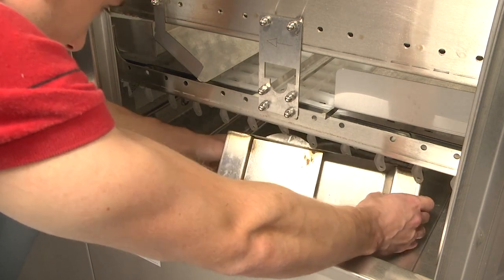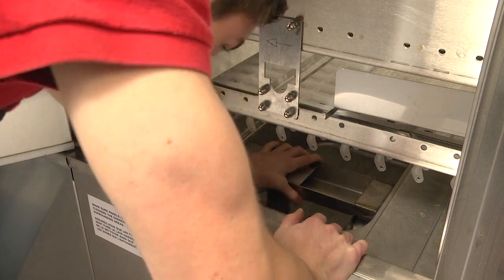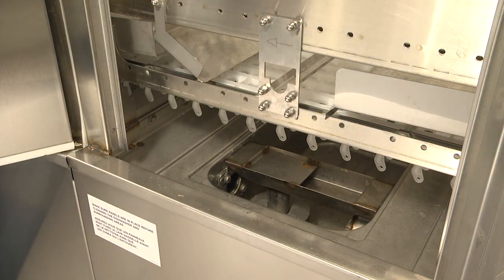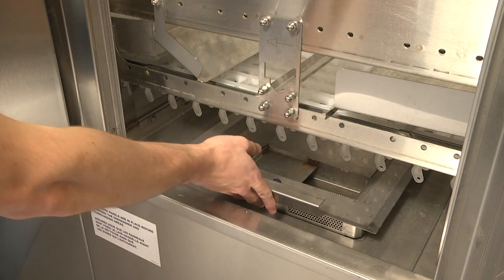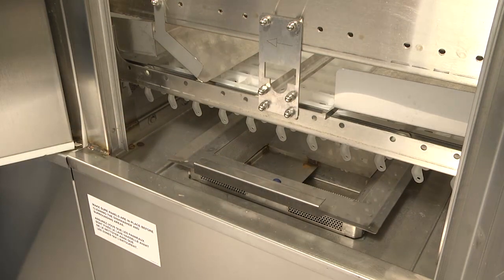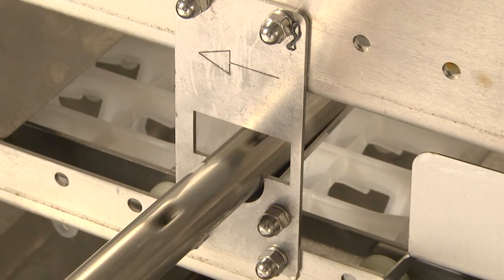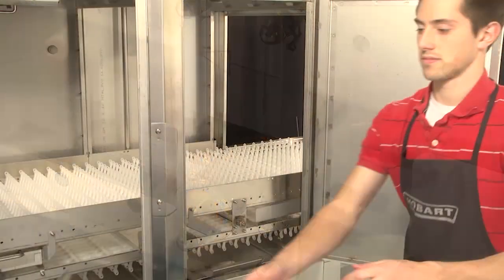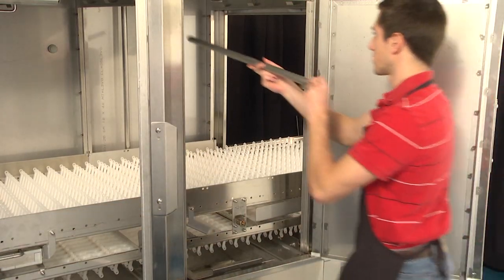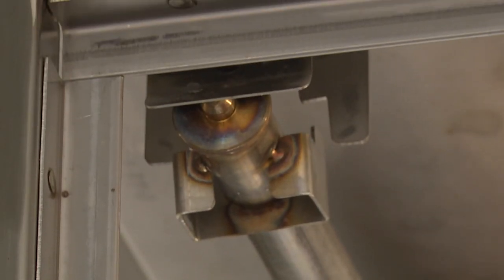To replace the soil collector standpipe, drop the bottom of the tube into the drain body located at the bottom of the ASR tank. Place the lower wash arm. Put the strainer basket on top, noting that it sits slightly higher than the tank. Replace the lower wash arm by following the guide rail and pushing the tube into place in the manifold. Replace the upper wash arm by pushing the tube into the upper manifold, pushing up and snapping into place.